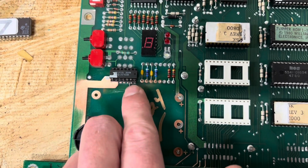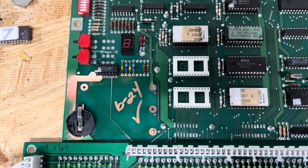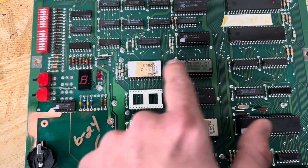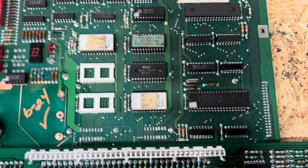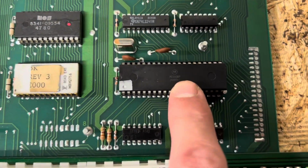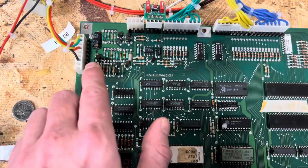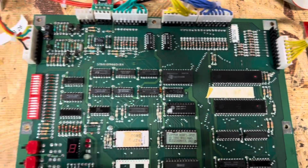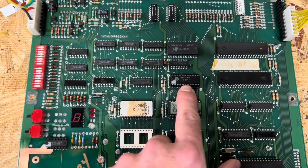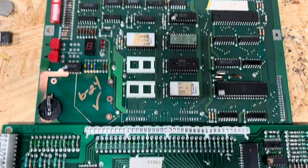Went ahead and pulled the 7400, placed that into a socket after abating and conformal coating where the alkaline damage was. As always, pulled the game ROM sockets, replaced those with brand new, as well as the 6808? Yep. And then also replaced the crystal. Replaced all of the 0.156 headers here, and also the filter capacitor. Desoldered the 5101 and placed that into a socket so it's easy to put in NVRAM now.